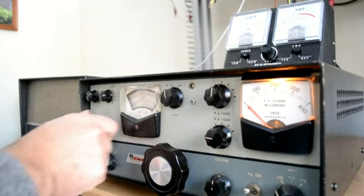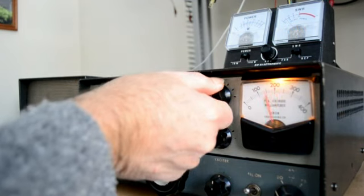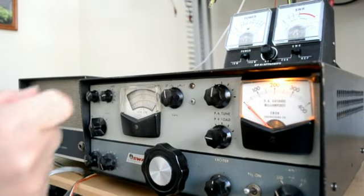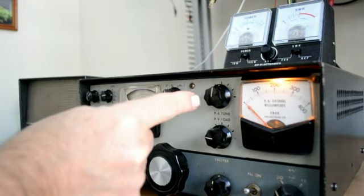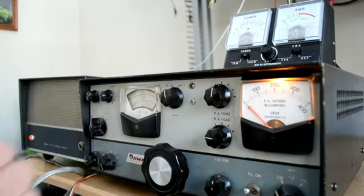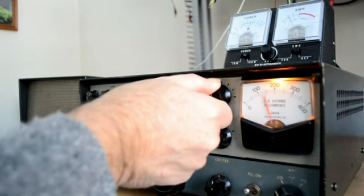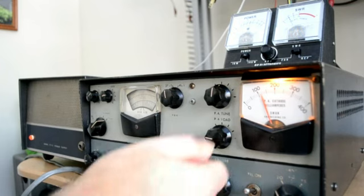So I'm going to throw it in the tune position, and then I'm going to dip this, and the reason I dip that is in a parallel resonant circuit. When you reach the resonant part, the current goes to minimum. So I've dipped that now, and I'm going to go back there, and I'm going to dip that, and I'm going to make sure that I have my maximum drive there,